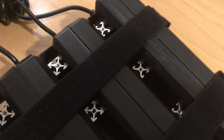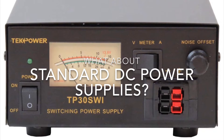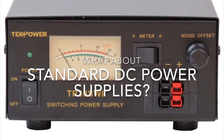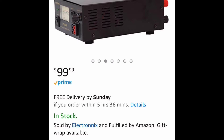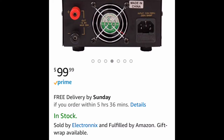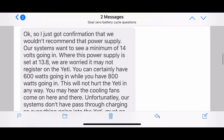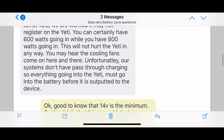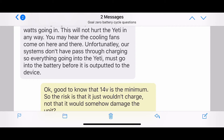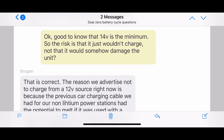Before I wrap up this video, I want to cover a few questions that came up. The first one was: why not just use a standard DC power supply? That's actually a good idea, so I went on Amazon and found one that looked promising — a 30-amp unit with Anderson PowerPole outputs putting out 13.8 volts DC. I actually chatted with the Goal Zero techs, sent them a link to the product, they sent it to the engineers, and the answer that came back was pretty interesting. According to the engineers, the Yeti needs 14 volts or more to really work — it won't register the charge if it's lower than that. So I think a lot of the popular DC power supplies for things like ham radio actually won't work. If you have one with variable voltage that can put out 14 volts or more, you're in luck, but otherwise a third-party charger will not work.